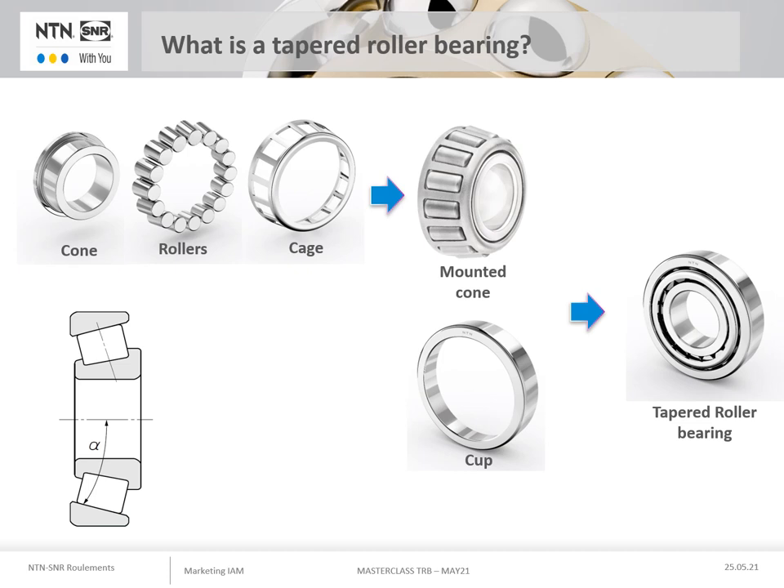What are the advantages of taper roller bearings? It is a line contact bearing so it has a very high load capacity and offers high rigidity to ensure precise guidance. It is a bearing in which the taper rollers are guided by the path of the cup, having an opening angle and by a shoulder. Taper roller bearings can therefore take up axial and radial combined loads. The greater this opening angle, the more the bearing will withstand significant axial loads.